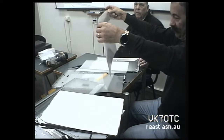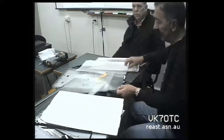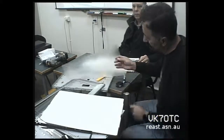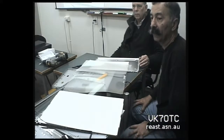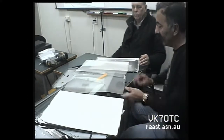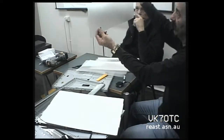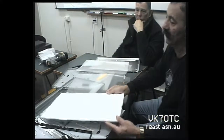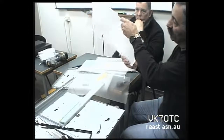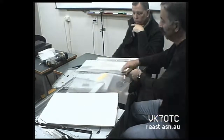As the light comes through, it's diffused out. If you take that off and look at the light, the light's going everywhere, whereas you put the lens on there and it's quite a directed light. And then the last one is just another diffuser again, I think. So there's not really anything in there. I think all the magic's done in that acrylic with the pattern underneath it to bend the light, and then this one to focus it.